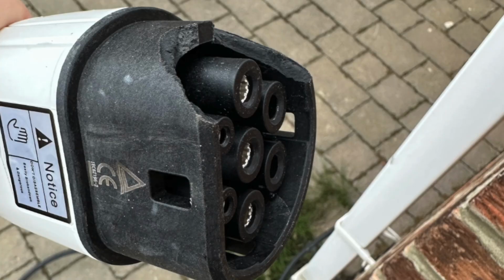Yeah, and not only if they just want to upgrade to the 8.5 from the 5.5 that they originally purchased, I think it's the one component that gets used the most. Even with an untethered charge point, that male to female type 2 lead is getting thrown in the boot. It's probably getting a bit more abuse than a tethered cable would, but again, 3 years down the line, 4 years down the line, if someone has neglected that cable assembly a little bit too much, then it can be removed by the installer, and in approximately 30 minutes you've got a brand new cable on there. And we sell those parts individually as well. So I think it's something to point out that they can be maintained. They're not just a fit and forget item.